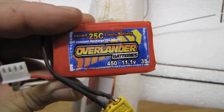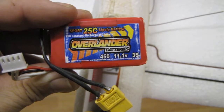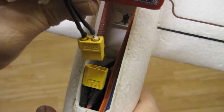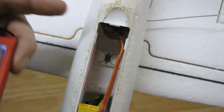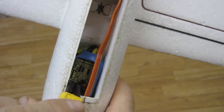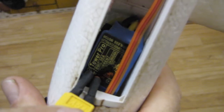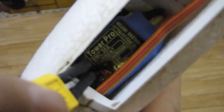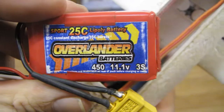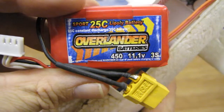There's a LiPo battery - 450 mAh - you can use a 500 as well. That's the inside. Hope that helps. I'll just use those connectors, and the receiver is there. The speed controller is about 30 amp. Hope you can comment below - I'll show it flying in the next video.